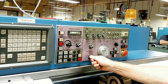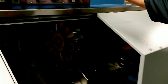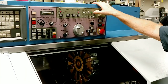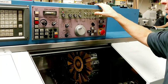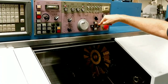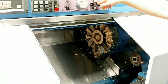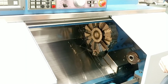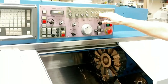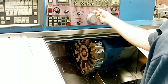We're going to shift over to handle mode and come up a little closer to the part. Homing the machine is crucial — if you don't home the machine, you're going to get bad numbers. If you're not sure, make sure you home it. Now we're 100% sure we homed it. I'll go to handle mode, feed up close to the part, and index my turret.